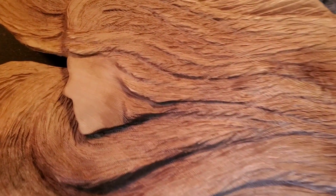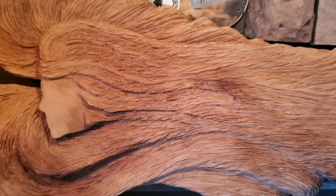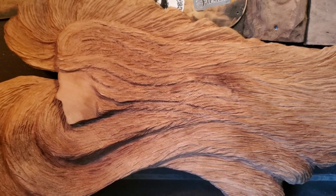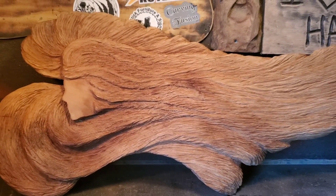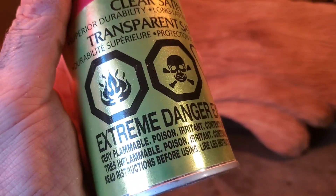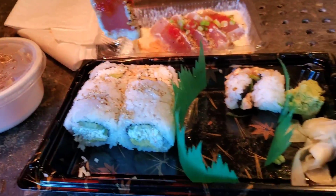I sanded it again and hit the face a little more to give it some shading. I talked to Pete just a few minutes ago — I asked if I could put oil over the top of the sanding sealer and he said, 'The oil is supposed to soak into the wood — that's the point.' So I decided I'm not going to oil it; it's dark enough anyway. I'm going to use this polyurethane I have lying around since it's an indoor piece.